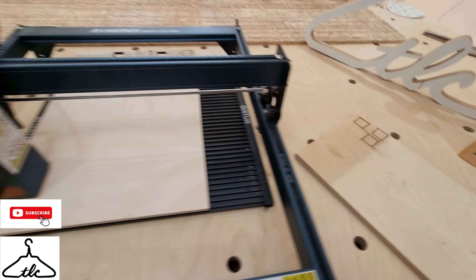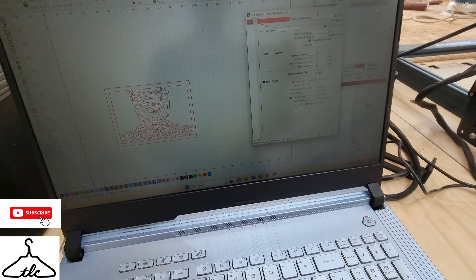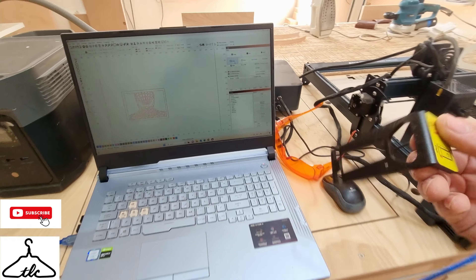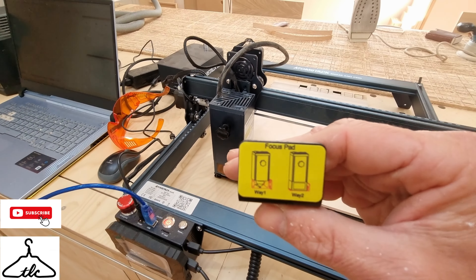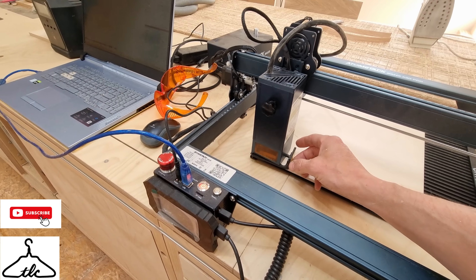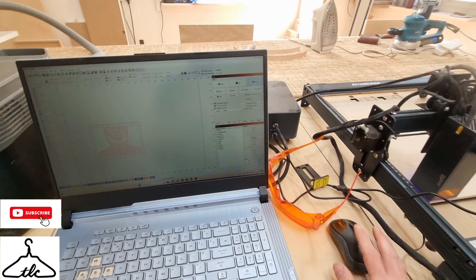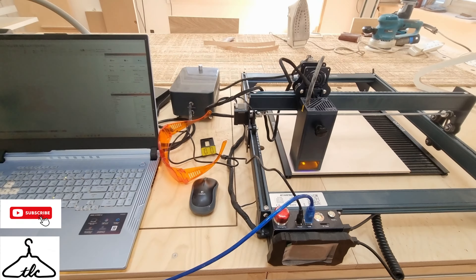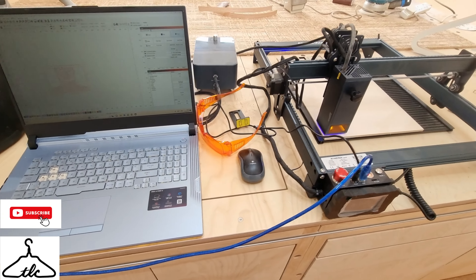I haven't tried it as a whole cut before — I've only been doing little test cuts, so it'll be interesting to see how this performs. I'm going to hit the frame button just to make sure it's in the right position. This machine comes with a little gadget that slides underneath and shows you the exact spacing you need. You can do it from underneath or to the side. I've got the window on, so that spacing works well. Don't forget the air assist — I nearly did! Starting now and I'll get the camera rolling to film the process.